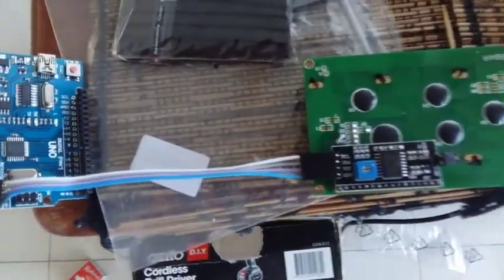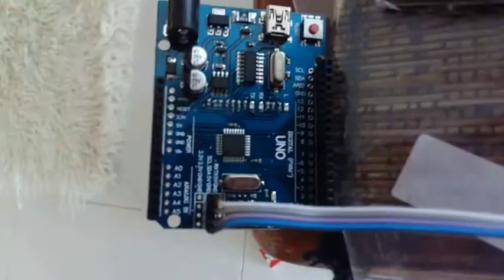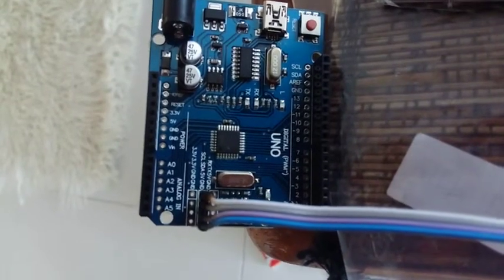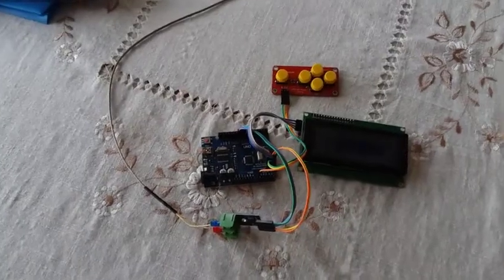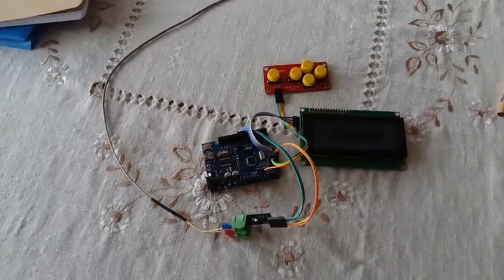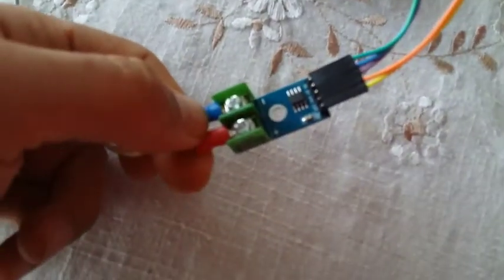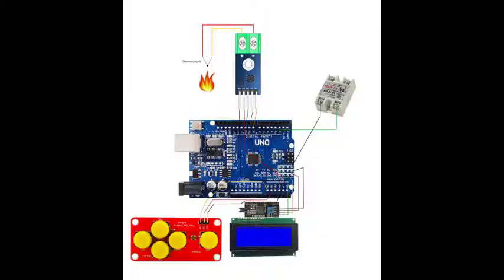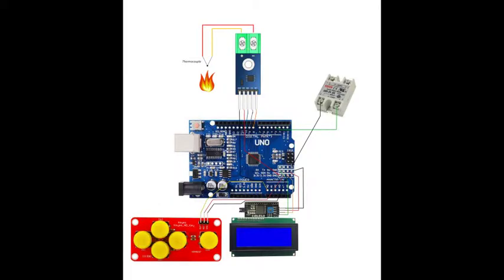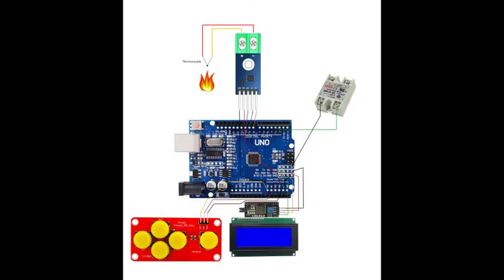Here's how we connected the screen: SCL, SDA, VCC, ground to Arduino Uno — 5V and ground. SCL, SDA, 5V, ground — so that's connected over here. Testing the Hello World. This is the assembled controller. You can see the Arduino here — Arduino Uno. This is the thermocouple interface, MAX6675, connected to 5V and ground on this end, and connected to pins 10, 8, and 9 on the digital pins end.